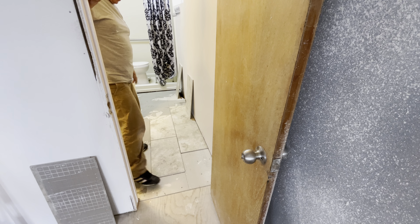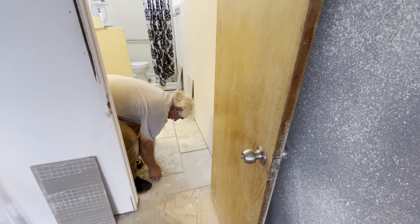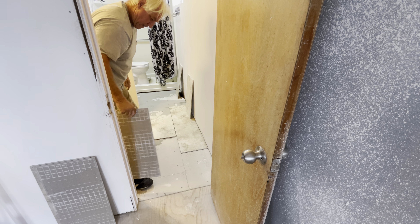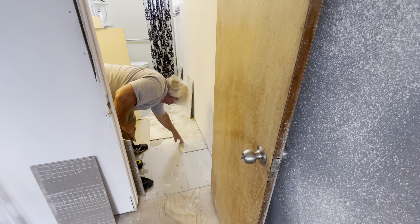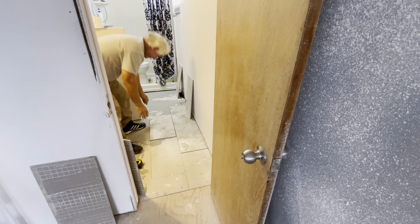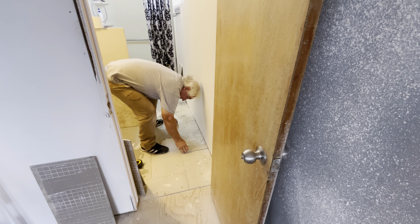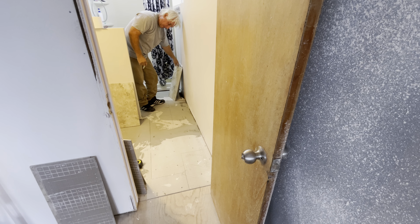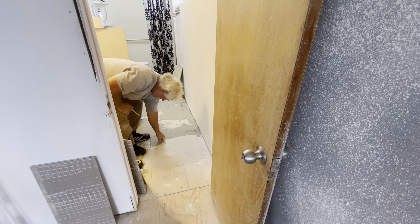Obviously I have a jog here, so that's not good. I'm going to want to go on this line, and that's okay because I'm fully aware of that. I would do these right here, these tops. Once you place some thinset, so you don't have a mess going all over, you're going to want to set right in here — those four tiles.